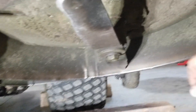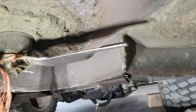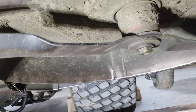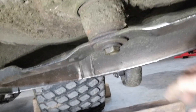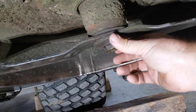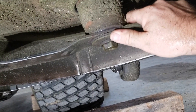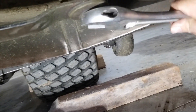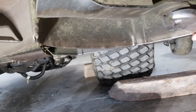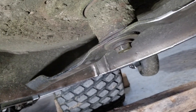This other blade doesn't have anything wrapped up on it. Notice this blade's not moving at all and that one kind of does its own thing. Remember in an old video I made a big deal about these spring washers and how important they are — they've got to be torqued just right, and if you overload the machine and they slip a little bit and get cooked, then they lose their springiness and don't work. Well, that's what we have here. The bolt is nice and tight — when I move that it's also moving the other blade — so it's not that the bolt is loose. It's that there's just too much space in here because those washers are now flat, not cone shaped like they should be.